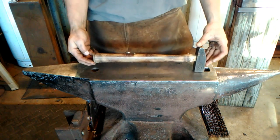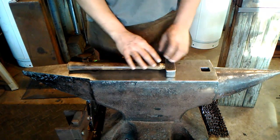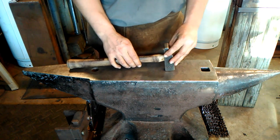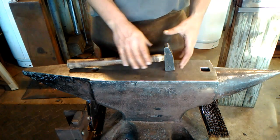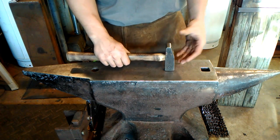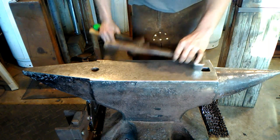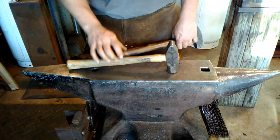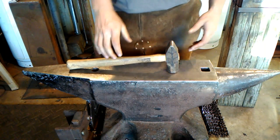The hammer is set on a 16-inch long hammer handle. I like long hammer handles with small weighted hammers for most of my work. It gives me much longer longevity in the forge and the ability to forge material up to about one inch with this hammer. Anything above that and I move up to a three pound forging hammer. This is one of the first forging hammers I ever forged with, so it's a favorite of mine.